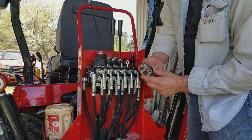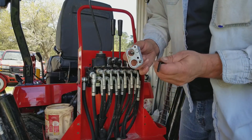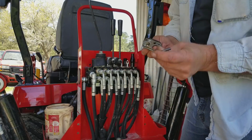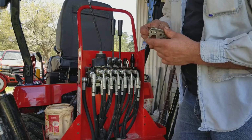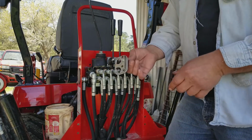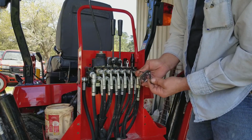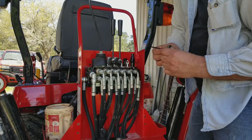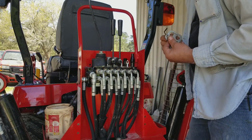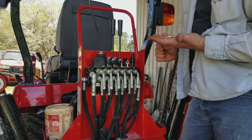I don't know if y'all can see that really well. It is a screw that loosened up in there. It's an Allen flush mount, smaller than this. So now we're going to tighten that up, and that is going to solve my backhoe issues. Alright, so we're going to unscrew it. Comes right out. Looks like they had some Loctite in there at one time. Yep, that is definitely red Loctite, or a version of it. It's a very short screw.